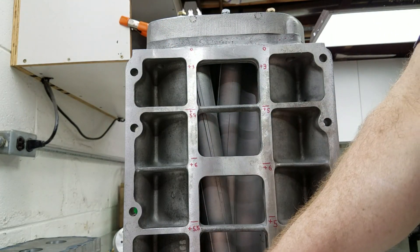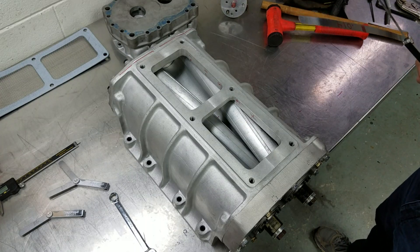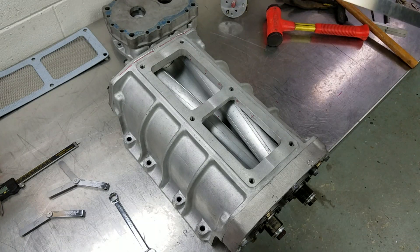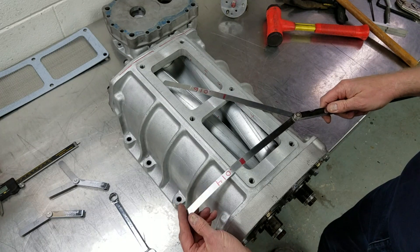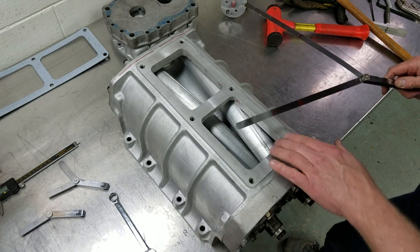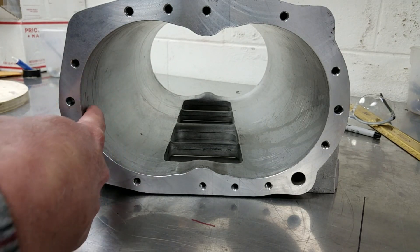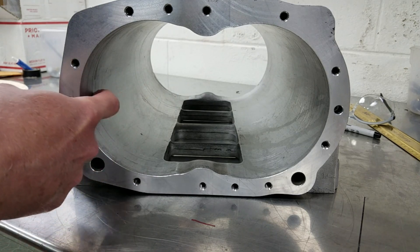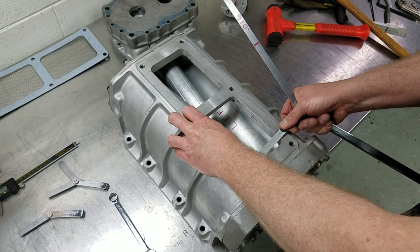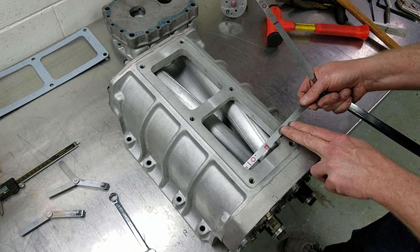After setting the bottom clearance, I have to recheck the side clearance on each rotor. You can't do a lot to change it except to make sure it's equal on both sides. I take my long feeler gauges with a red stripe marked about halfway down, corresponding to the outside edge of the case where the rotor should be measured. Measuring along all four corners of the case between the tip of the rotor and the case wall, I slide the feeler gauge in — this side has a side clearance of between 14 and 15 thousandths.